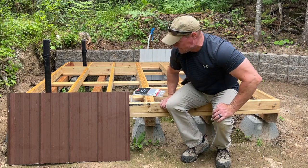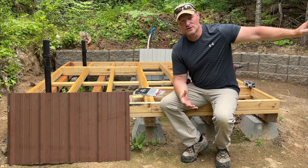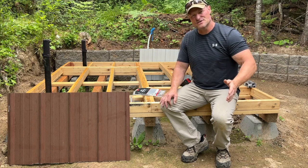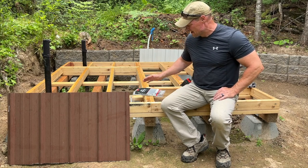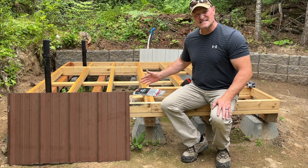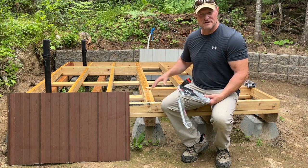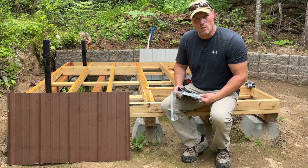So I wanted to show you that because what I've decided is I have quite a bit of extra insulation from the cabin build, and it's for a 24 inch wide stud spread. This is about 18 inch gaps here, but I'm going to go ahead and cut those and lay this insulation in this flooring. One of the things I didn't do is put an underbelly under here, like the pressure treated plywood that I did on the cabin. So I don't want this insulation being torn out by critters, and I need it suspended and maintained in here. So an easy way to do this, because I've already screwed the frame down to the 4x4 foundation, and this is a bathroom, it does need to be insulated because there's going to be water and a shower in here.